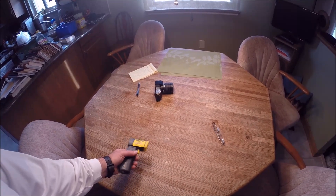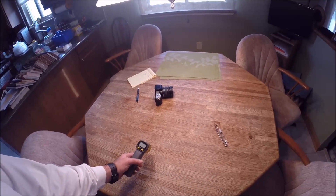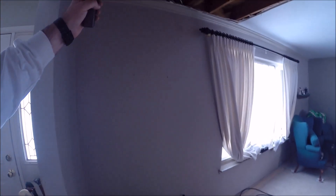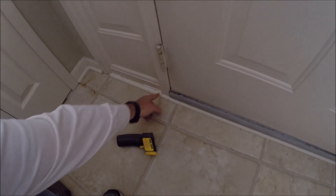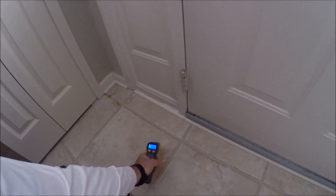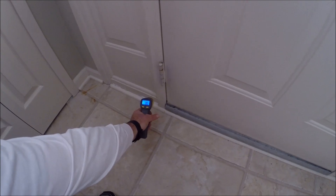This is a cool infrared thermometer — I'm sure you use these for making glass. This shows you surface temperature. When I went up in here first it was in the 20s up inside there according to this. I noticed down here on your front door — see this white along here? That's ice. The floor is 58 degrees but right up in here is 27 degrees.